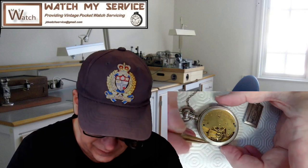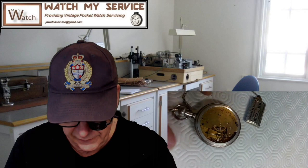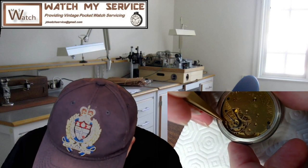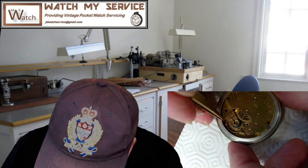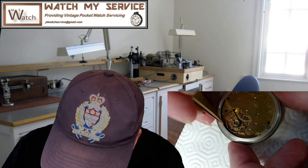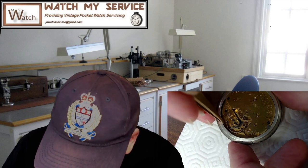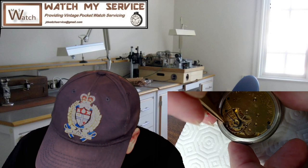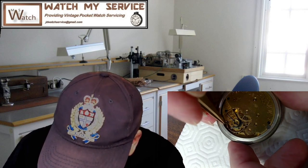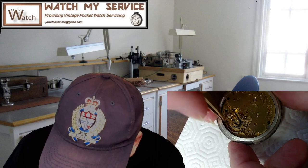And if you see this, I'll just move this in nice and close so you can see what I mean. You see how that just sort of goes bang bang? That's because that impulse jewel is hitting the other side of the pallet fork and can't go through. So that is an issue, and it can only be rectified, I think, by adjusting that impulse jewel, I believe.